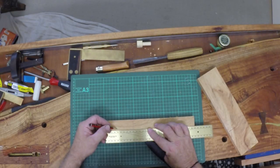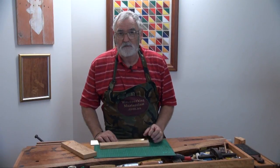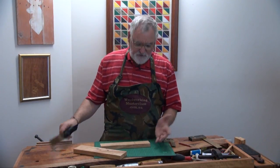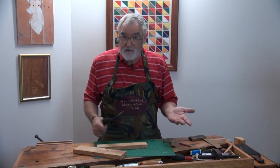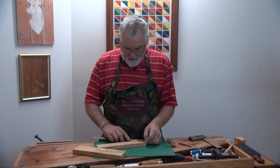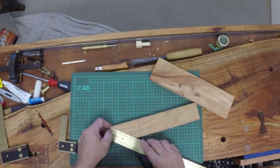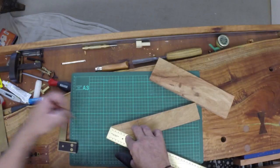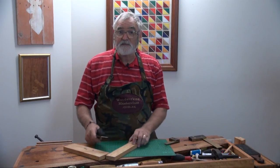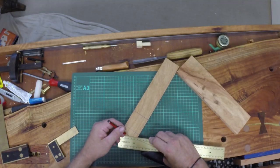If I come down 40mm, I'm going to put a 30mm hole in there. To find the centre, instead of measuring and trying to be spot on with a ruler, just go from this corner and swing your ruler around until you get a number you can divide by 2. In this case, that measurement is 90, so 45 is the middle. Alternatively, you could use 60 and mark 30 — that'll be the middle too.